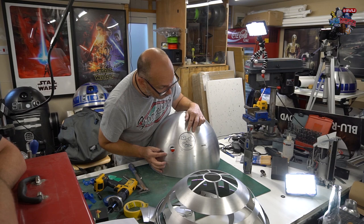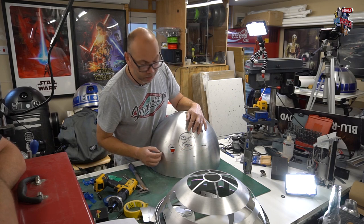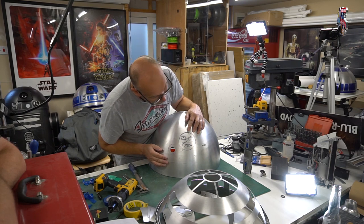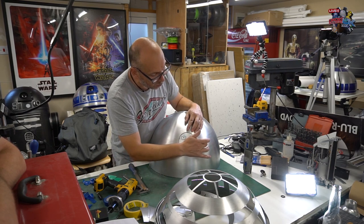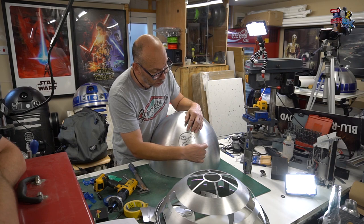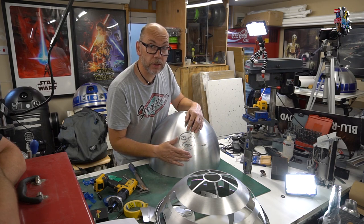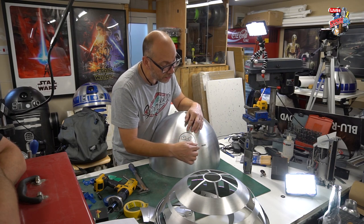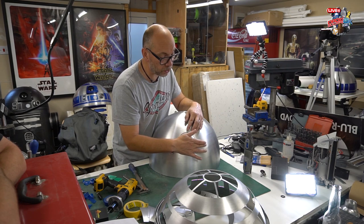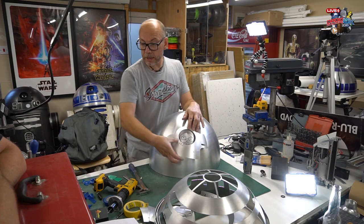That works. Right, let's go on to, I think we'll finish big. So you're doing the glory hole last? I'll do the glory hole last, okay. Wow, do you need one that big? So I'm going to do this one now, which is just going to be drilled with an M5 drill bit, and then as many holes as I can manage, and then I'm going to get a file out and make that into the nice rectangle it needs to be. Again, if it's slightly oversized, it doesn't matter because it's going to be hidden by this. And this is where you can have a lighting display or whatever you fancy putting in there, whether separate LEDs or some lighting screen diffusion. So yeah, I'll do that now.